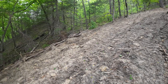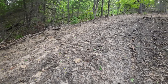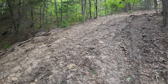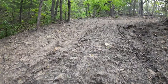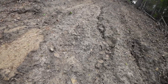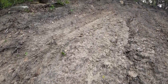I think I need to take that edge down — take that whole edge off, which I did a little bit with the excavator. But I can't get my excavator from here; it's too steep and too sandy, and we're having problems with the excavator right now. So I'm having a guy come with a dozer and he's going to regrade this, hopefully get it built up or get the side taken down so water doesn't run down. There was also a water bar here that was working to get water off the trail, but it fills up with sediment and then it doesn't work anymore.